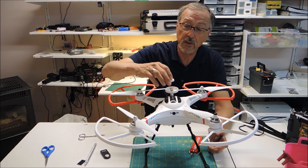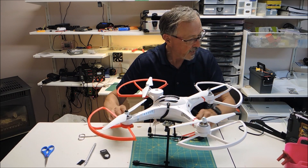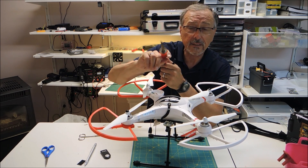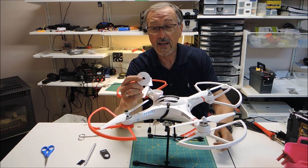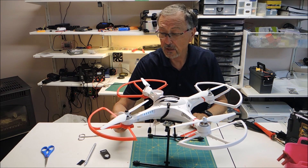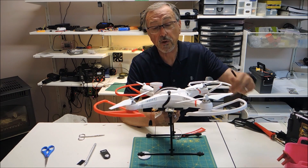I should have thought of that — it seems so obvious. I was going for having a really good look, but that won't work. So I put a little hole in the side of the case. For cutting the hole, I use this HobbyCo hot knife — I use it for cutting foam, plastic, anything like that. It does a great job. When you melt this type of plastic, I think this is ABS, it actually leaves a nice ridge that reinforces the hole, giving you a nice reinforced edge all the way around. It does weaken it slightly, but it does have some reinforcement.